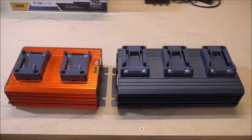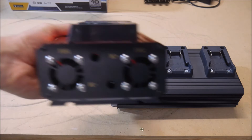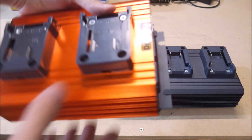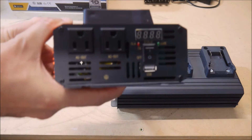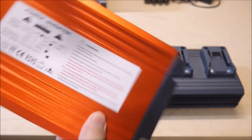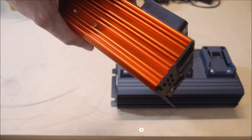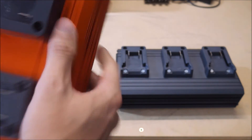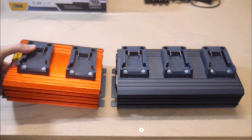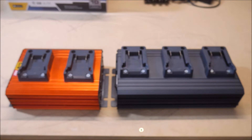On one side are two cooling fans, and on the other side are the AC outlets and an LED meter that switches between displaying the battery voltage and the AC frequency. It has an on/off switch so that you can turn off the power from the batteries, because there's about an 8 to 10 watt load on the batteries even when nothing's plugged in. The only major difference from the 600 watt model is the 1,000 watt version does not have a USB port. There are removable fuses inside the case, and it comes with several spares in case you blow one.